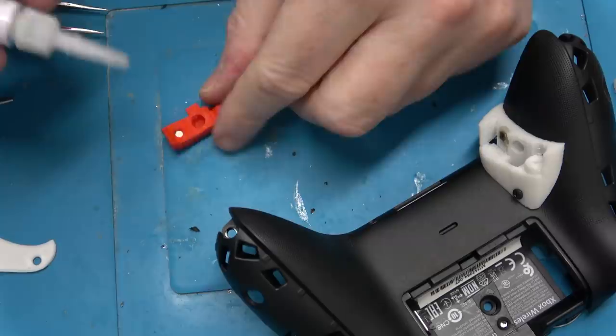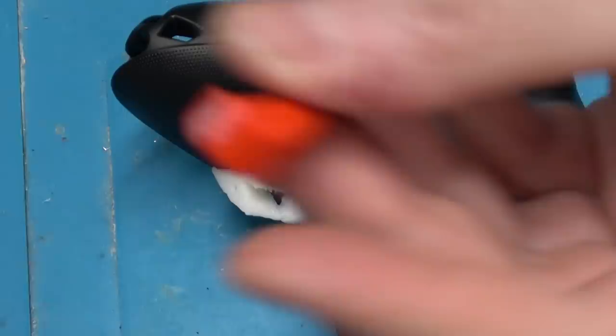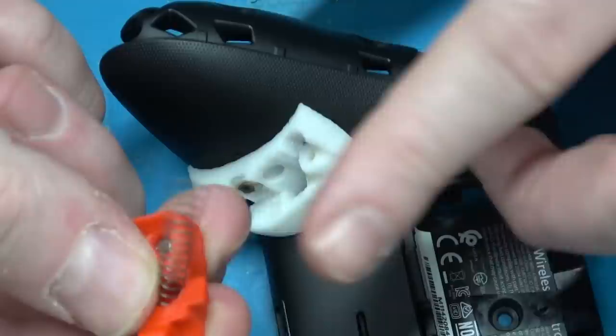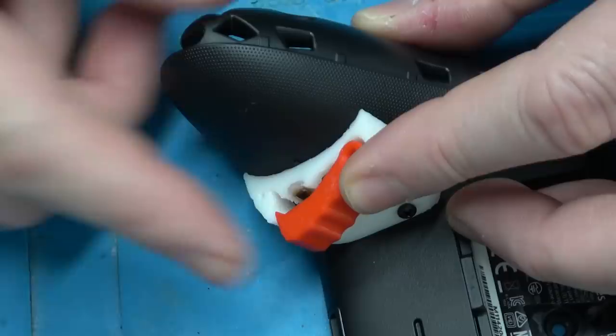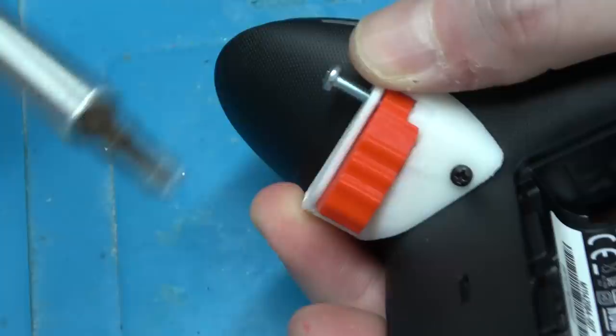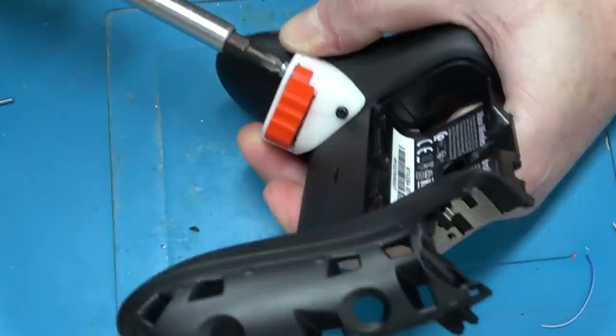Take a little bit of super glue, push down the magnet. Now let's assemble the trigger. There's a little tab there which prevents it from springing all the way out. I used to use half a spring to save money but the full spring gives you pretty good bounce. You don't want it to be too hard to push the trigger, because when people have a limitation with their hands and are doing more things with one hand, you want things to be easier to press, not harder.